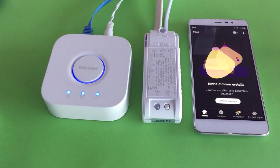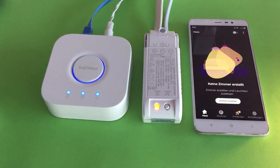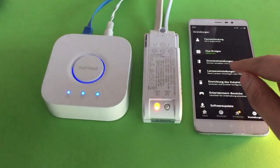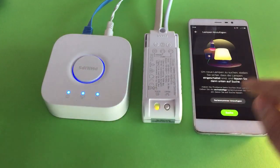Let's demo how to use the Philips Hue Bridge and Hue app to pair with a new Zigbee 3.0 light controller. On the controller you can see a little red light keep flashing, which means the light controller is ready for pairing. Go to the Hue app, click Settings, go to Light Setup, click Add a Light, and then click Search.